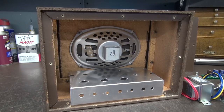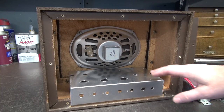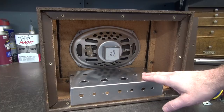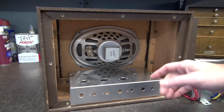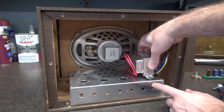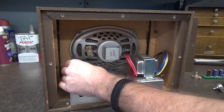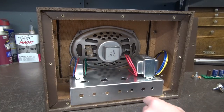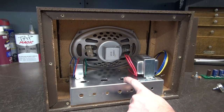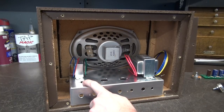I'm approaching this like those cooking shows — I'm going to show you how to make a soufflé, then pull it out of the oven already done. I did that to speed up the process. Here is the drilled chassis sitting in place for our little 3-watt amplified speaker. Your power transformer is going to sit here. Output transformer will be back here. We're going to have a 6X4 rectifier, 12AX7, and then the 6AQ5 output tube.